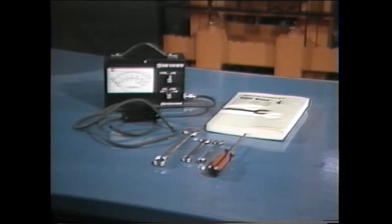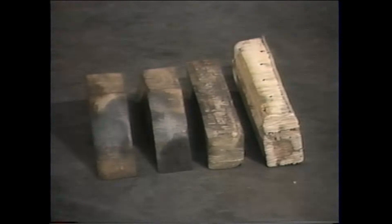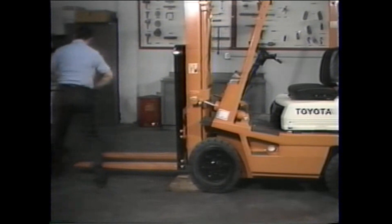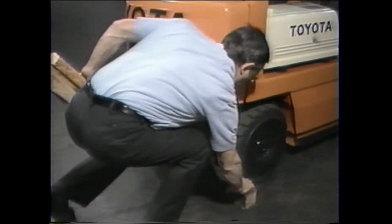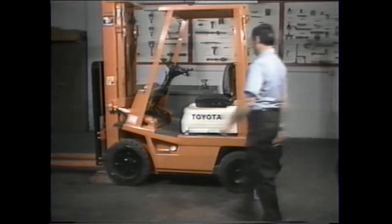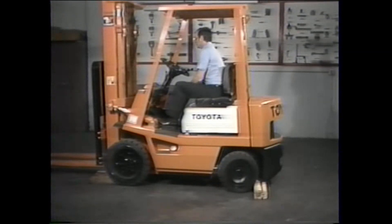The tests are both conducted using a normal selection of hand tools, but you will also need an engine tachometer to precisely monitor RPM changes and a set of four wood blocks. The blocks will be used to secure the truck during testing. Take two of the blocks and lock them against the front tires. You will be running the truck at full speed during testing and must prevent the vehicle from lurching forward. Take the remaining blocks and secure the steer tires so the truck can't jump backward. With the tires blocked, apply the handbrake as a final bit of insurance.